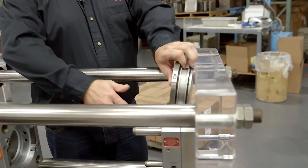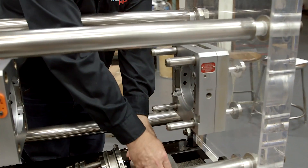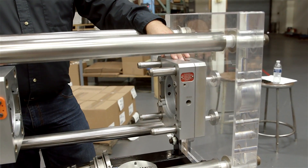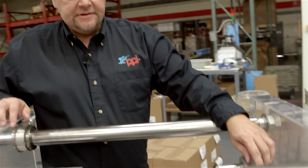On the A side you can see that the A half stays in the molding machine and you're not purchasing this steel over and over again. There are several options for hot sprue bushings and for cold sprue bushings that are interchangeable again in the press.